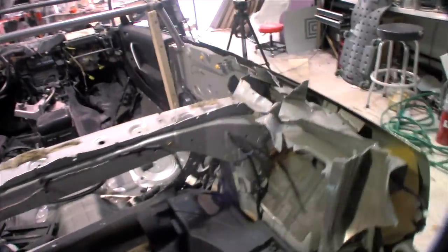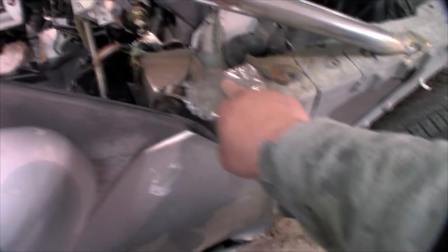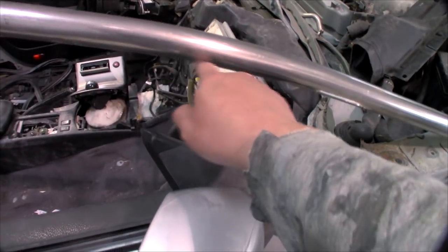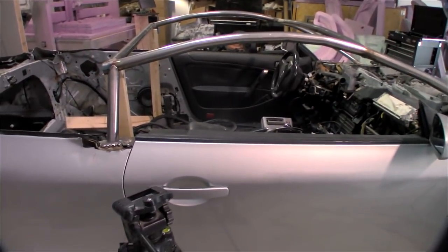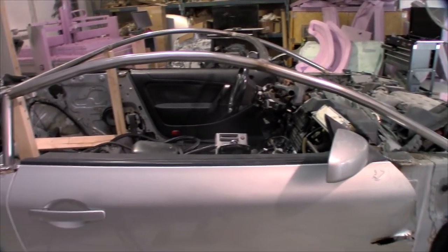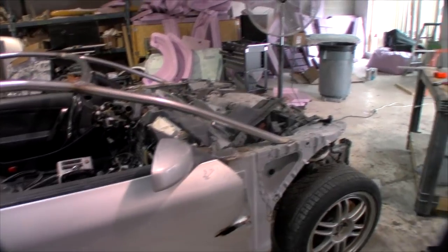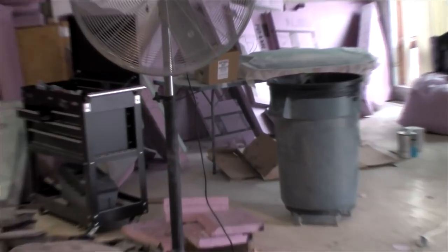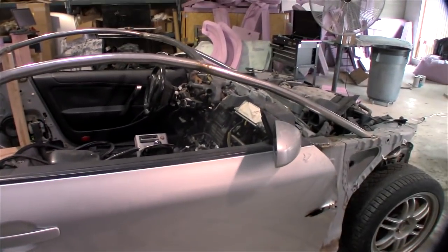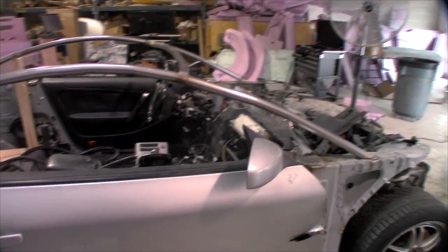There are two more posts I have to make up in front that go from the base plate to around here. We're just going to weld in the four corners and that'll be it for the roll cage for now. Then we're going to start making the body panels — I already have a few parts: the hood, the two fenders, and the two door skins.